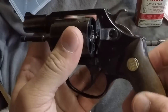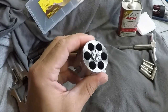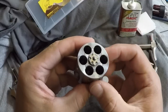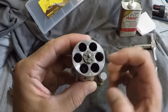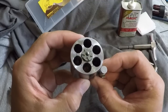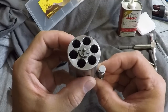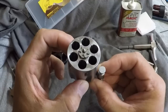So I practiced on this gun. I'm going to put that away and get the other one out — just a couple of cylinders left to do. The top ones here were not done. You can see, and I'll rotate it here, there's no angles cut in these top two. I'll rotate it around and you'll be able to see the reflection in the metal in that chamfered area. That's all you're doing — just putting a 45-degree angle in that area.